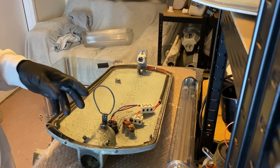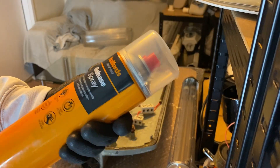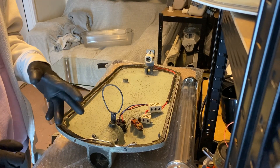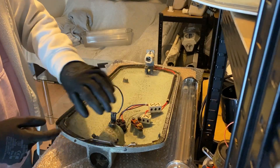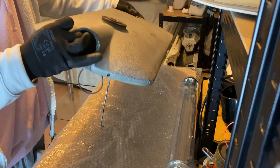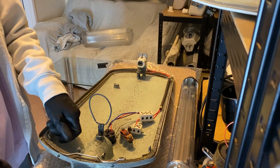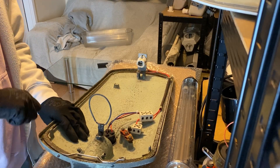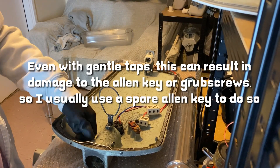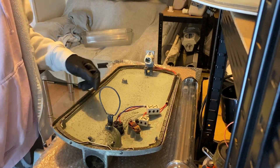Both grub screws do turn. They did require a little bit of persuasion. I have a new trick up my sleeve — some Halfords release spray. I usually rest the lantern, spray it on the top of the grub screws, and let it sit for a couple of hours depending on the condition. If the grub screws are particularly corroded, I'll leave it overnight. Then I'll flip the lantern over and spray some in there as well. Then I'll put an allen key in and try it, and if that doesn't work, I'll tap at it with a hammer until it comes out. It did require some persuasion to get these free, but they are free — as are all of the screws in this lantern, every single screw is free and turning.